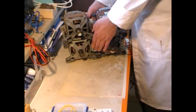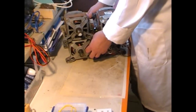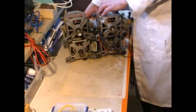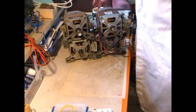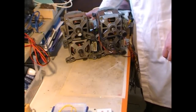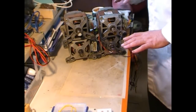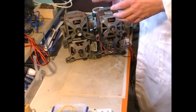And the reason for that shaft is to act as a jack shaft. So you'll have a larger sprocket on this side, smaller sprocket on this side going to the larger sprocket on the wheels. There will be 2 cogs identical on the output of the shaft because I should be having 2 wheels on either side. The reason for that is it can carry more weight because that's where the motors are going to be in the back.